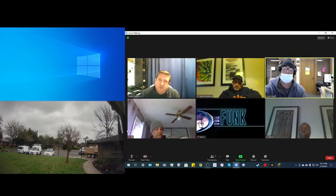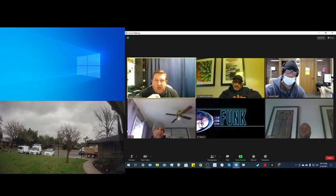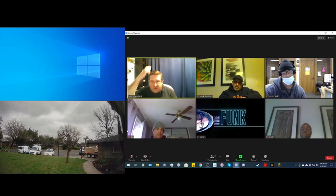Robert, your question: Hey, how do they get the designs in the floors? Good question. I love that. So in the polishing process that we showed, where the guy was grinding and polishing, after the initial cut, a lot of times what will happen is somebody will have created that design. Now, in the case where you saw the big star design, that is what's called saw cuts. So they will lay out a design on the floor. They will draw that into the floor. Okay. So they'll trace it on the floor.